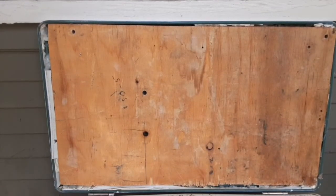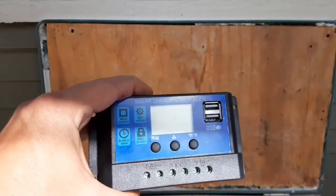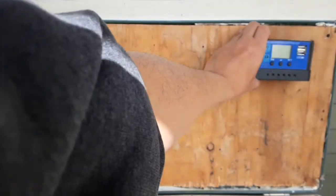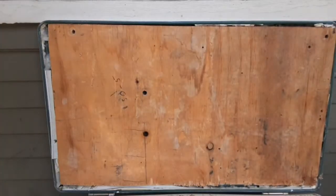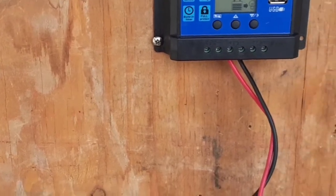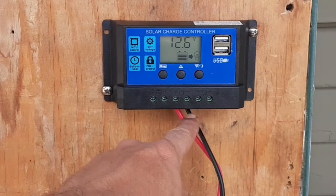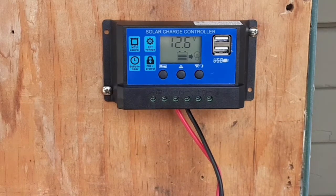As you can see here, I mounted a board up here — since it's a metal lid, I wanted to keep it electronically neutral — so I can mount up things like this charge controller. This charge controller is a 20 amp maximum input charge controller, got off Amazon for about 10 or 12 bucks. I have it hooked up to the batteries here; the negative lead goes straight down to the negative on the battery pack, and the positive lead goes just before the terminal, where I put a 20 amp fuse on there for safety and connect it to the positive from there.